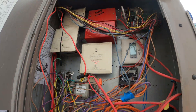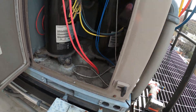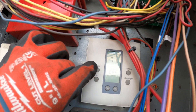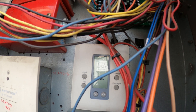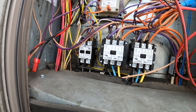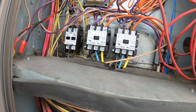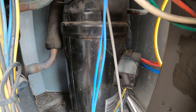That is a beautiful thing. Close this all up, put this panel back — I took it out because everything was so tight; it really made things a lot easier and it looks a lot cleaner. Looks like we're good to go. Let's turn this thing on. Let's set the thermostat — it reads 71, go to mode, cool, bring it down to 68. Right there — that contactor pulled in. We know that's good; that's our evaporator fan motor. We took a look inside: the belt is a little wobbly but it's okay. And she's running — the compressor started.